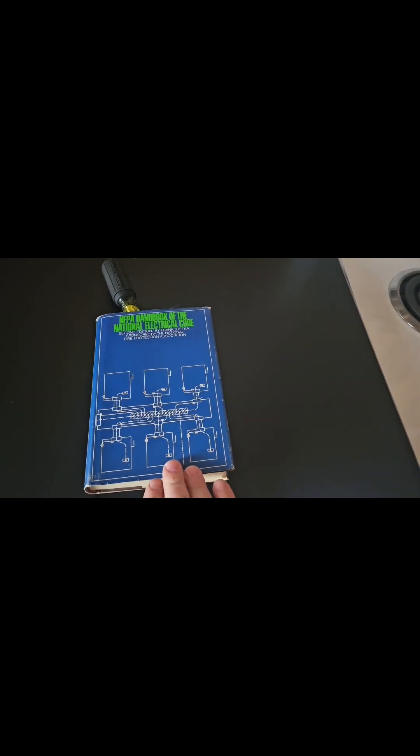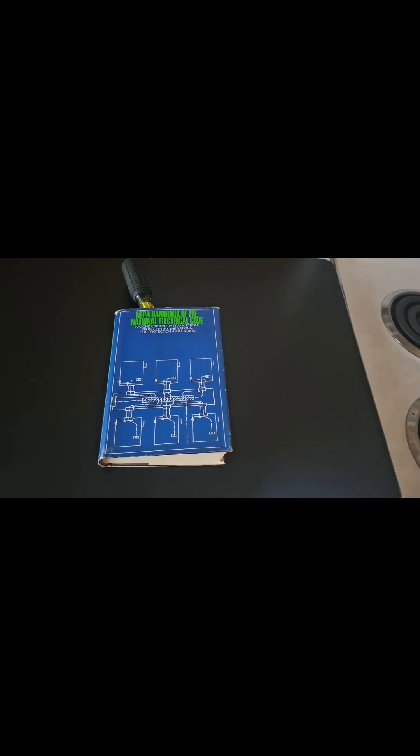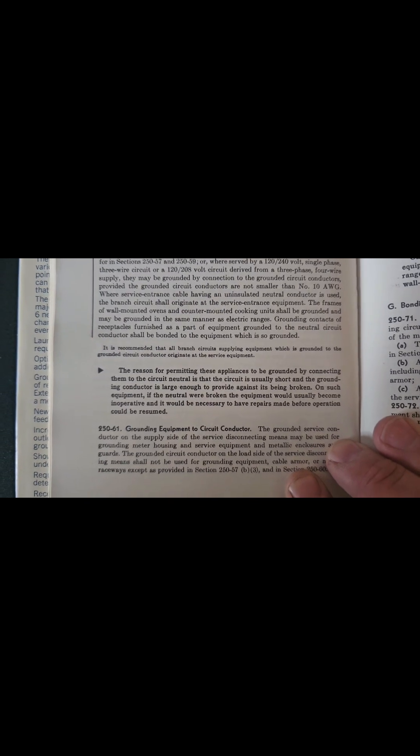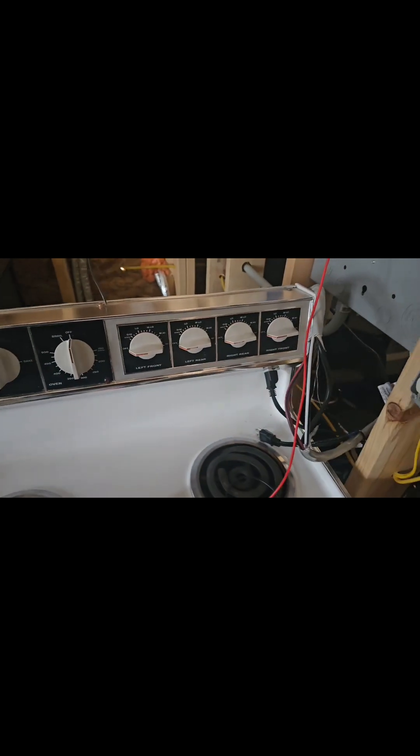So what I have here is the 1968 NEC handbook. In here, the handbook gives you the insight of why back then they thought it was okay. Here's the rule that lets you do it in the times you're allowed to — this is 1968. Right here is the reason why they say it's allowed: 'The reason for permitting this...' Basically what it says is the wire and the circuit is so large it's unlikely to be broken, and when it does become broken it becomes inoperative — which is not true. This stove works completely fine without a neutral. All the burners and oven work without an imbalance, and all the controls work without a neutral — everything is 240 volts. To get the imbalance, I had to use the accessory outlet.